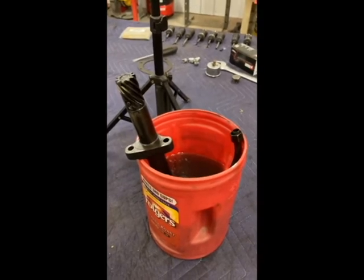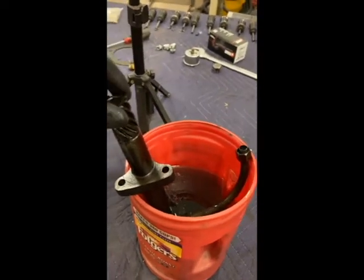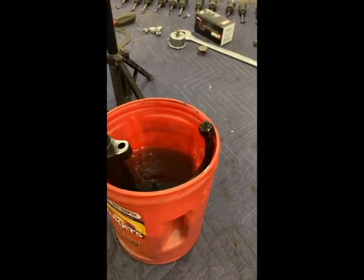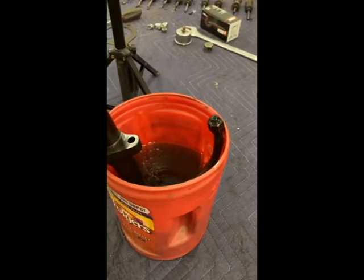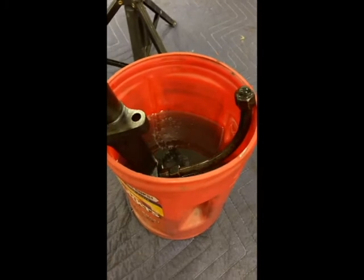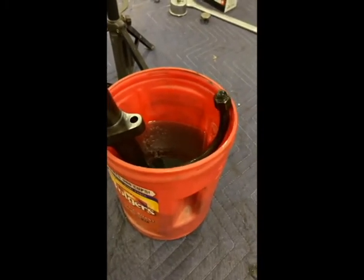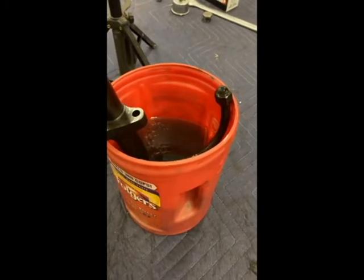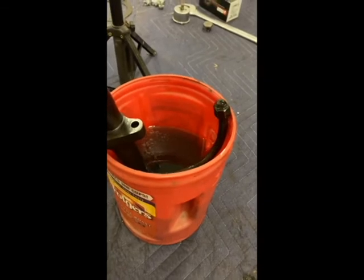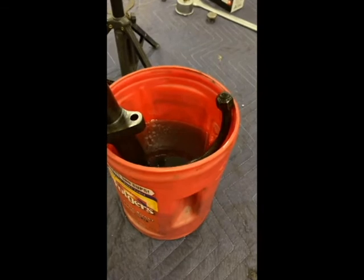I want to test the oil pump before I reinstall it onto this 45 rebuild WD — it's got the 45 engine kit in it. I've got a little coffee can here full of oil and I just wanted to make sure that my pump was clean and had good flow before I put it back in. That way if there's anything in there, it's not getting pushed through my oil system. I primed it, got it primed.